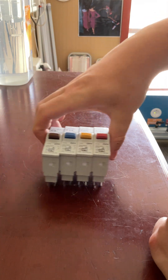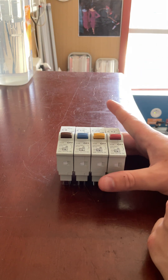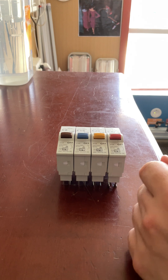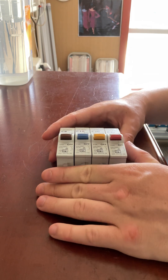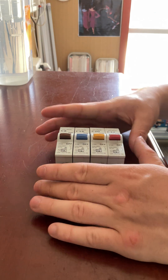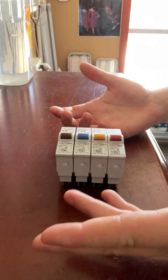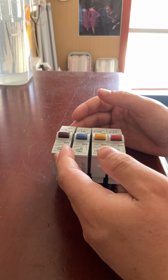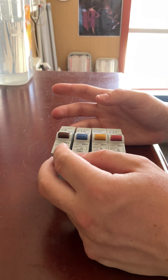In a lot of newer houses you most likely won't find these — you'll only find these on older houses, probably those built before the 80s or perhaps even before the 90s. The hardwired breakers have been out for quite a while. On my particular house we've got a bit of both — we've got a couple of the plug-in ones for our lights and power, and we've got the hardwired ones for our oven, solar system, and RCD.